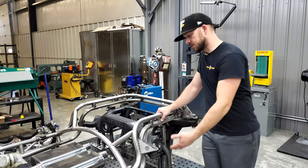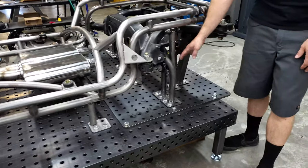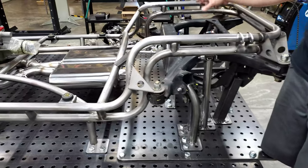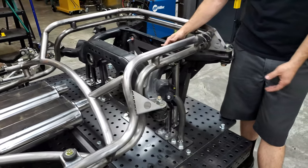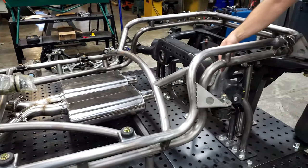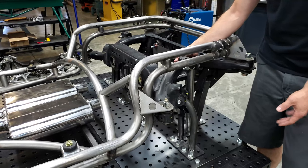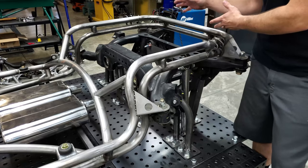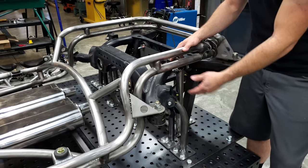Basically what I'm going to be doing is cutting the rear of the frame off and taking the cradle out. I've already built all this jig fixture stuff to go to all the suspension mounting points and pickup points, as well as holding the differential in place. So when I cut the frame rails off and take the cradle out, it'll just be the fixturing left, and then we'll be able to build the tubes to come from here and pick up the mounting points in a similar location to where the frame sections are on the cradle itself.